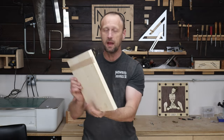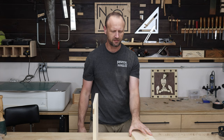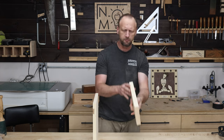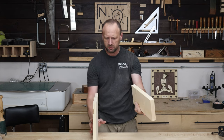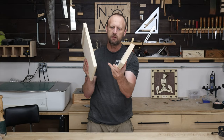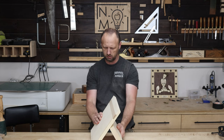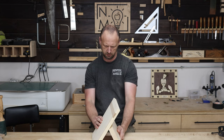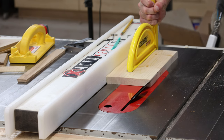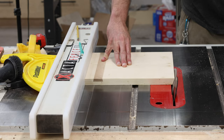The dovetail is in and it's not looking too bad. Now I need a stand, otherwise it'll just fall over. I've got another board — I need to cut a bevel on it so it mates onto the back, and then cut bevels on the bottoms of both pieces so that when you splay them apart it will sit flat on the counter. So I've got to go to the table saw, figure out the angle, cut the bevels, and figure out how to attach it.